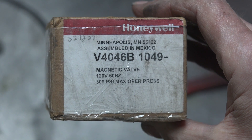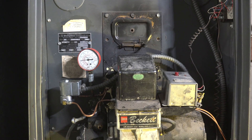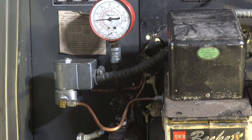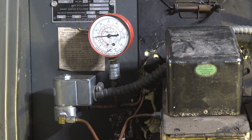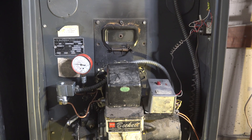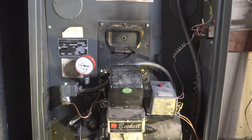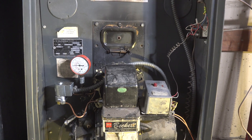The B actually worked really good. Here we have the solenoid valve installed — it's 120 volt, so it's energized when the burner motor is energized on a call for heat. It's just put in the gun line. It's a pretty simple installation, not tough by any means. That's the effect of the solenoid installation on the oil-fired furnace.